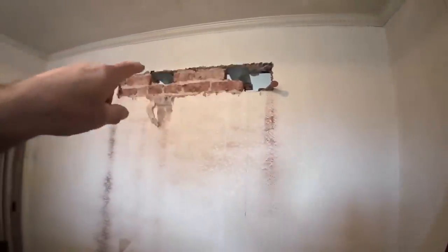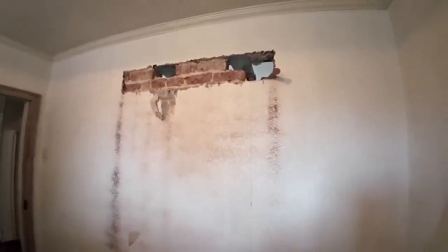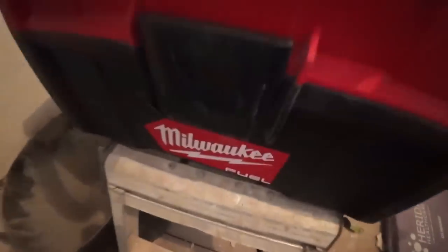So, like I say, the bricks are nice and soft, the lime mortar's nice and soft. Would have been a lot quicker with the sawzall, but we forgot that, because I was thinking we wouldn't be able to cut the bricks. Sawzall probably would have gone through the bricks, actually. But, pity that. So it's stitch drilling all the way down. Saving all the bricks for a window that's getting bricked outside on the garage. We'll have a quick break and get stuck in after break. Right, break over.